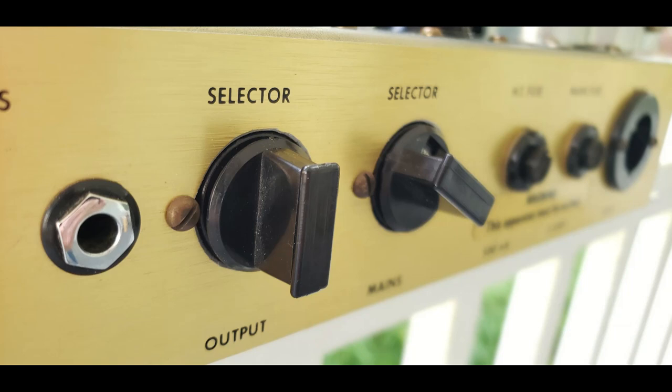These are still physically good, but it's very common, especially for the Cliff type jack, but even with the Switchcrafts, the metal frames that people know from Fenders, for metal fatigue to set in, especially if something has a jack in it a lot. The metal just loses its spring. It doesn't make enough forceful contact against the tip and sleeve of the plug. And so as they lose strength, a speaker cable doesn't want to stay in. It can actually fall out.